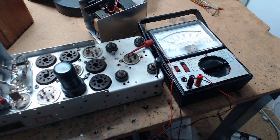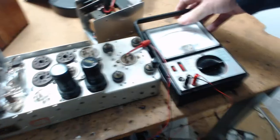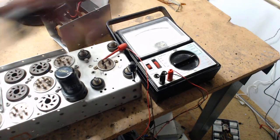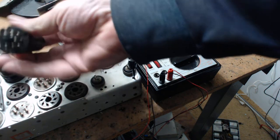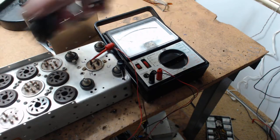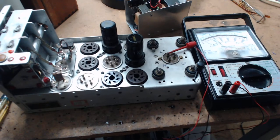In my case this radio was all wired in parallel — now there are three series strings wired in parallel. I put a tube in and get a reading; take either tube out and the reading goes away — that's a series string, but only for those two tubes. I move the same tubes to another socket and get another reading: string one and string two are both in parallel, going to the same voltage source. A third socket pair also gives a reading — so we have three series strings total.